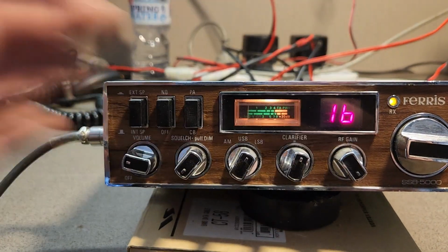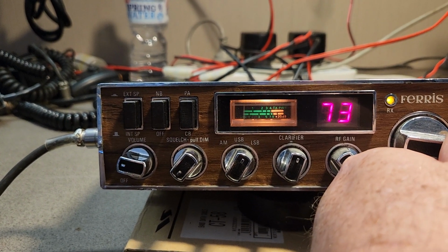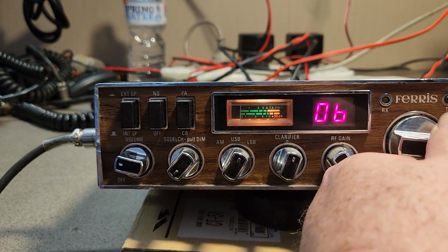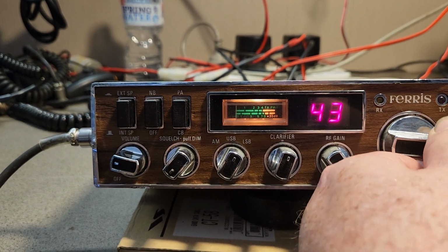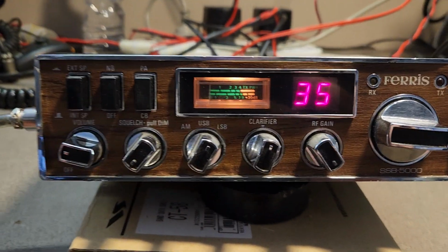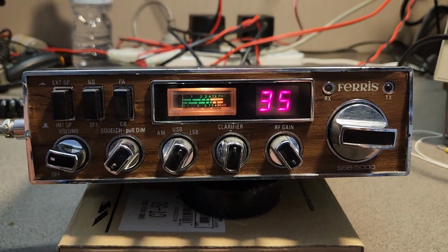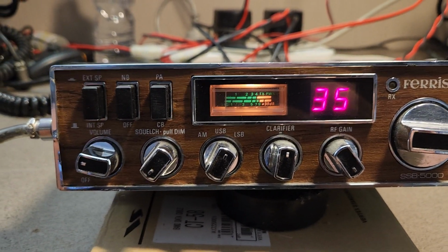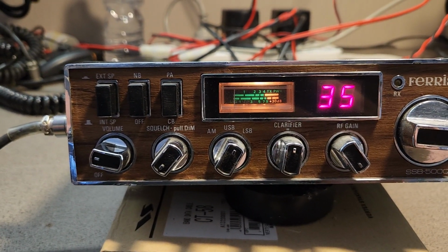It's like a plus light. It says you are now plus, so you are now in 28 megs. So this thing could be used straight away on 28490, etc., and then you're back to normal channels as in 35 with the TX indicator just indicating the 5 kc, etc. So yeah, it's an interesting one in the fact that if you're using a clarifier slide and you're using the 5 kc unit, this would be a nice transverter radio, giving you flexibility over those 10 kc slots that CB radios have normally got.